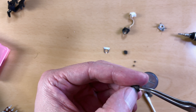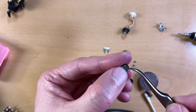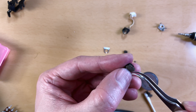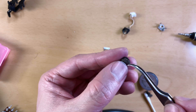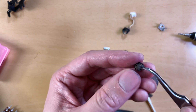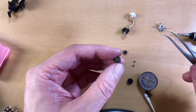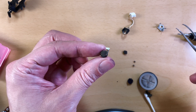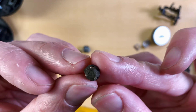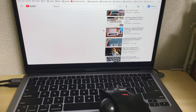If you're fixing a gaming mouse, you're going to have to spend a lot of time working with the thickness — it will affect how easily it turns. Mine ended up pretty tight, but it did loosen up over time, so that was good. Key thing three: make sure the wipers can make contact with the track — you don't want the foam between the wipers and the track. Mine here, it doesn't look like they're showing proud, but I tested it and it worked. Here's what it looks like after I've used it for a while — you can see it looks well set-up.